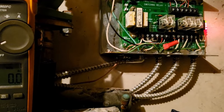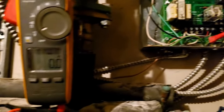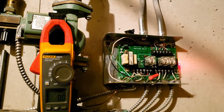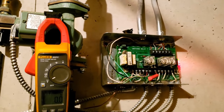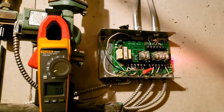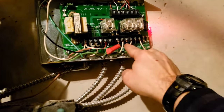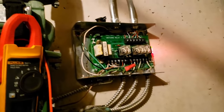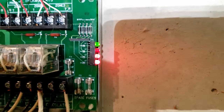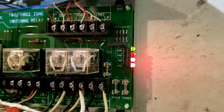This is high voltage — my normal disclaimer: don't play with any of this stuff unless you're a trained professional and know what you're doing, don't kill yourself. I'm going to kill power to it and check the back side to see if the traces are blowing out. It's almost like something went wrong and blew out the neutral. I used my jumper cable and jumped from neutral over to these neutrals and each one of them ran — full 2.3 amps. Something's wacky in the board.